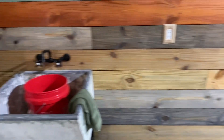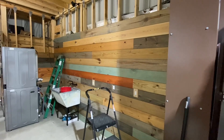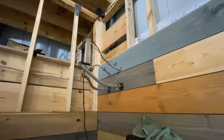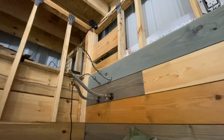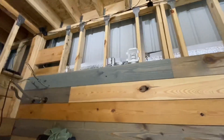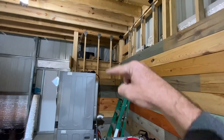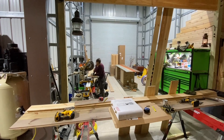It's about 4:30 and Emily says we're going, so I guess we're going. Here we are at about 5:30 — still going. I had to take the water heater off, so I had to disconnect all the plumbing. With PEX, there's a special tool — it's like two pairs of pliers that squeeze together, you can get them on Amazon. Had to undo all the electrical too — there are two 50-amp breakers for this tankless water heater, so obviously triple-checked to make sure the power was off. Next board, we've got to cut around where the studor vent is, the outlet up there for the TV and the stereo. She's cutting the next board for me to make holes in it.